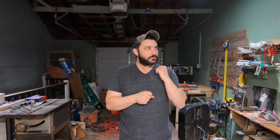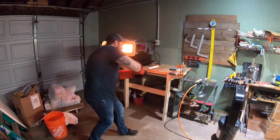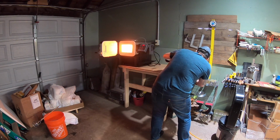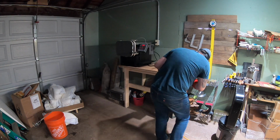If you didn't see all the Instagram stuff, basically what happened was I did K390. I did a pre-soak of 1500 degrees for 10 minutes, and then ramped up to 2150. The final soak was 2150 for 15 minutes. And what happened was I used this coating.